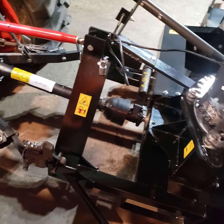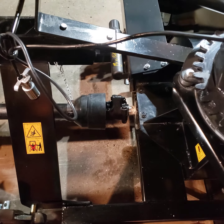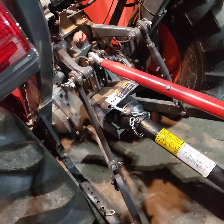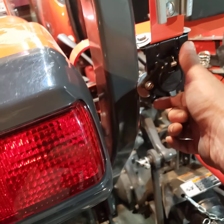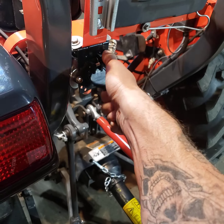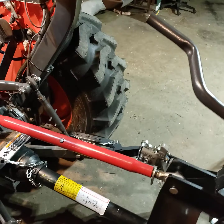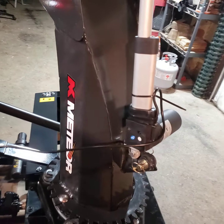Okay, back to the blower. Bolt on, PTO, 2 bolts come out, slide it on, put them back in. Quick disconnect on that, and I probably covered that. Here's my, I didn't want to drill anything, so this is kind of funky here, but we got a trailer plug. It's a 7-pin, I believe. I'm only using 2. That's what comes off my actuator. So let's get to that.